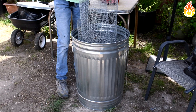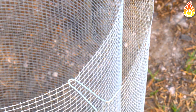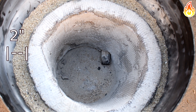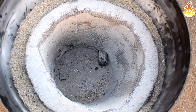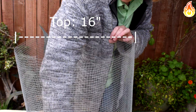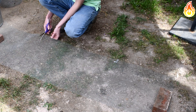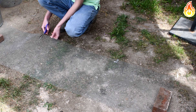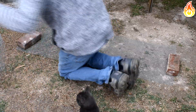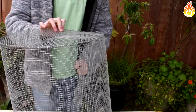That tapered approach ended up being a bad idea — if I did it again I'd make them straight. The lining thickness I went with was about 1.5 inches, which seemed reasonable to keep the furnace from weighing too much. For insulation I wanted about two inches of vermiculite surrounding the trash can. The outer bottom diameter of the lining needed to be 14 inches, and the top outer diameter 16 inches. I cut the inner mesh, outer mesh, and a 16-inch circle for the bottom, then attached all pieces together with steel wire.